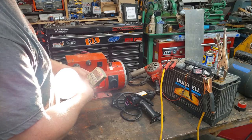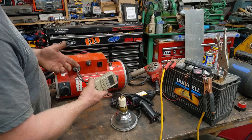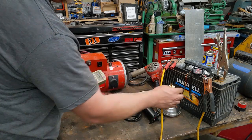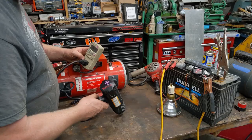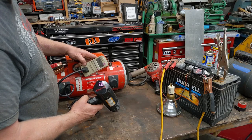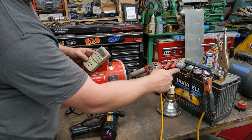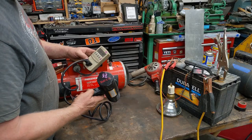Running at a little fast 64 Hz and I'm drawing about 100 watts at 130 volts, so the voltage is a little high right now but this is a really low draw. If we unplug it — yep, okay. The meter alone is just enough power to keep it running. This heat gun draws 1250 watts on high. Even though it doesn't draw very much at idle, while this is running it's pulling 20 amps, which is quite a bit just to stay kind of idle.